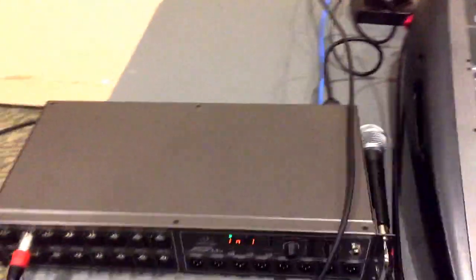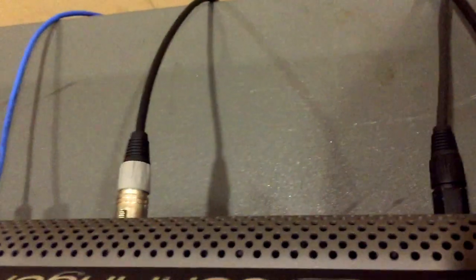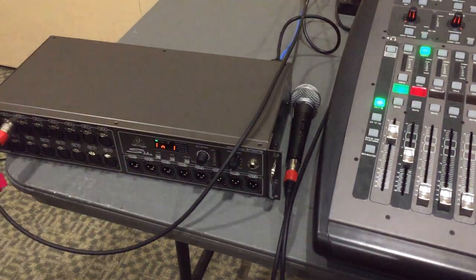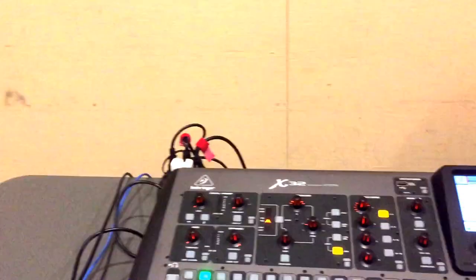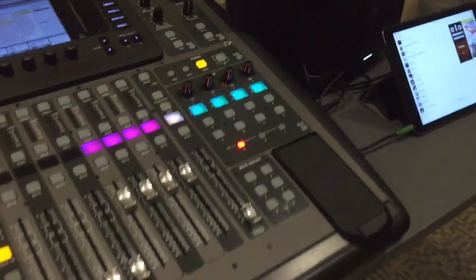Something else I found interesting: when I change the input routing, it doesn't affect the outputs — the hard IOs in the back of the console on the output side. So in essence, when I'm using this snake box, if I'm using output 1 for the main PA, I also have output 1 here on the snake. Feasibly I can take two lines — one coming out of the console with bus 1, and one from the snake with bus 1. The input channels are either/or — either local or from the S16 — but in the case of the outputs, it never disengages the back of the console. I was told you could use a patch to get around that, but I kind of like it.